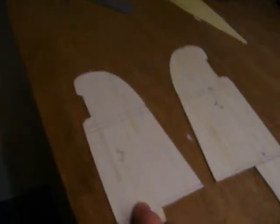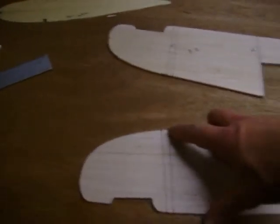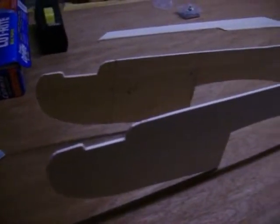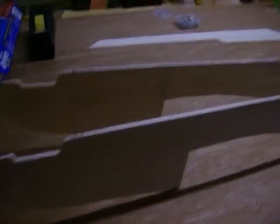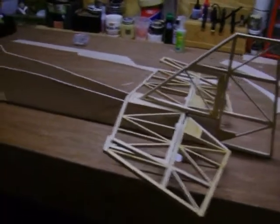I went ahead and transferred all my marks. You can do it two ways: line these up, make a mark on the top and the bottom from your template, just draw lines up here — they are going to be covered anyway. Then transfer them over when you lay this flat down. Do it on top and bottom so you have good straight lines, then just connect the bottom to the top and everything will be nice and straight. With everything lined up and matched up, stand the fuselage sides on their side and you can actually see what your plane is going to look like.